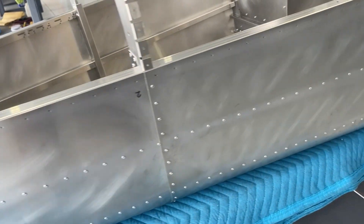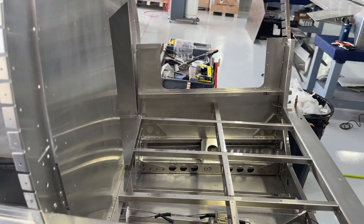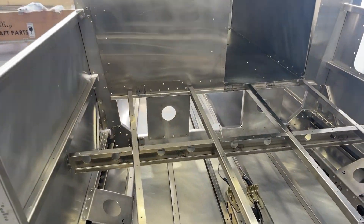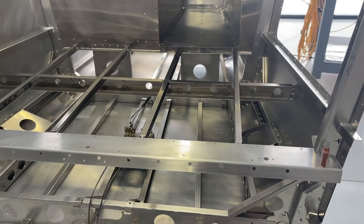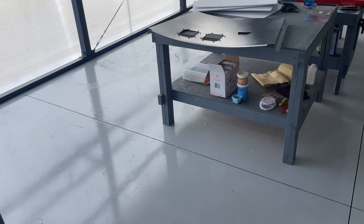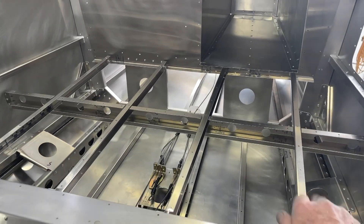The side skins took some time. Now I'm dry-fitting the luggage extension as well as the luggage floor and luggage bulkhead. I had the floor in here temporarily to make sure things all matched up, then took it all out because I'm going to put foam on the bottom. I've got those areas marked off, so I'll foam that for insulation and soundproofing. I've got the stringers all riveted in, including the side piece for this crossmember.